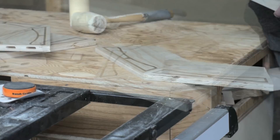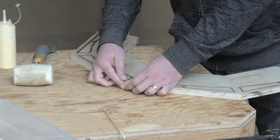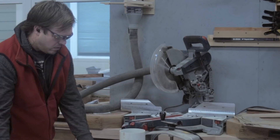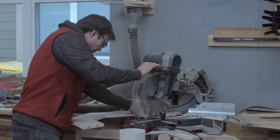It was very likely that there would be some error in the angles. Even a tiny amount of error multiplied across 16 cuts left me with a gap of about a millimeter. So I took one of these halves to the miter saw and shaved off just the smallest amount. Then over a series of test fitting and shaving off just a fraction, I had a good final fit.